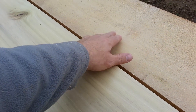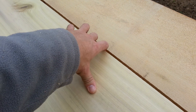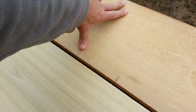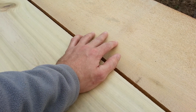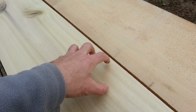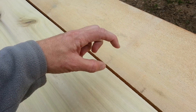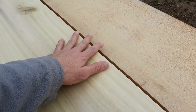I'm using rough cut poplar board — this is a piece that's already been planed. I like using it for two reasons: it's readily available, it's local, and it's a lot cheaper. With rough cut, it's a true 10-inch board because it hasn't been planed, so you can use it for the deep supers. If you buy shelving boards at Lowe's or Home Depot for the deeps, you have to buy the 12-inch boards because 10-inch boards are planed down to nine and a half, which is too small a width to make your deep supers.